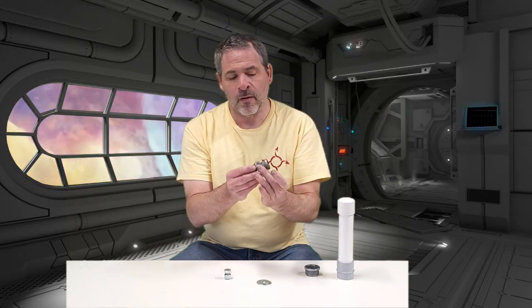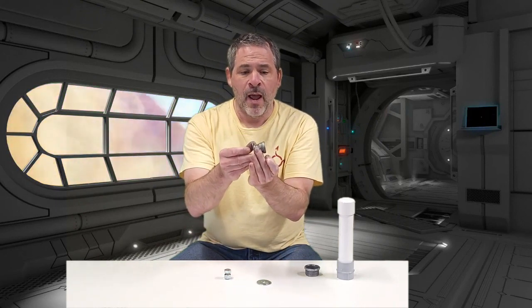We have two types of nozzles that we're going to try. One is just a simple washer-style nozzle, and we'll be using a bolt where the orifice will actually be drilled through that bolt. That's going to allow us to change the orifice diameter very easily by just simply changing out that bolt. And then, after we get a final thrust test on that simple washer nozzle design, we're also going to add a small divergent, which is made out of a steel plumbing fitting. That's simply going to sit on the nozzle so that we get a divergent, and we'll see if that offers any more thrust than just the simple washer design. So let's get building.